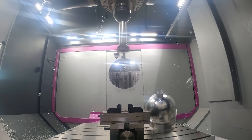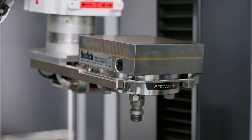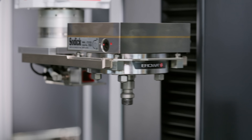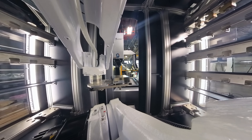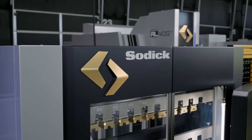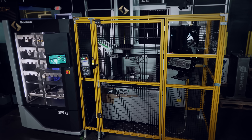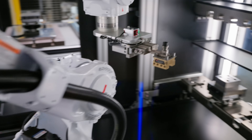You know me — I like to create the worst case scenarios. You know the super cool little things built into the PLC, like the way the robot tips the pallet to get some of the dielectric fluid off of your pallet. If you're looking to automate your sinker EDM processes, this is how you do it. With 60 electrodes and 10 pallets, you can load those pallets up on a Friday afternoon, go home, go to sleep, and this thing can run all weekend long, unattended, with almost zero operator interference. And we all know that automation is the future.